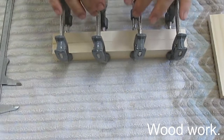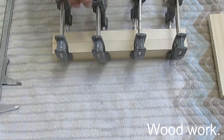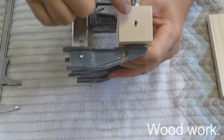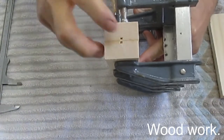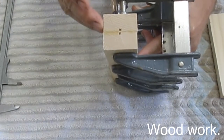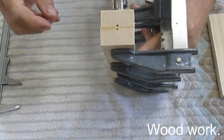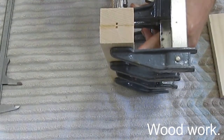Once you've applied the glue and put it together like a sandwich, you've got to clamp it. Because there's more glue on the ends, you need one clamp at each end, and of course a clamp in the center too. After about 45 minutes clamped like this, you can take it apart. One important thing when gluing: you've got to be very careful to align the slots at both ends. If the wood is not quite right, line up the slot — don't worry about the wood, because the lathe will round off the edges anyway. It's really important to have that slot lined up so the stainless steel goes through.